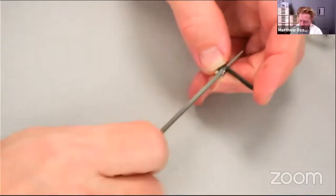So remember, you will be familiar with this drill if you're a regular here, and if you're not, then it's new territory, that there are three kind of rules of soldering. The main rule is that everything you want to solder must be clean. So get off any oxide, old work, down to bare metal, add flux, which keeps things clean and reduces the surface tension of the solder as well, and then get the thing up to the right temperature, and you've got to have somewhere for the flux and the solder to run.